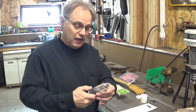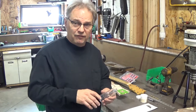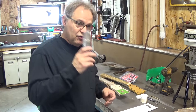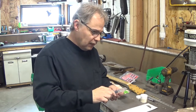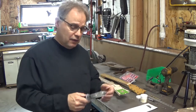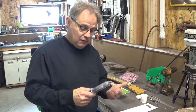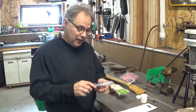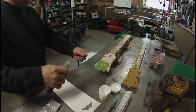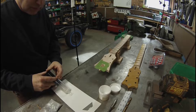I've tried several different kinds — you just want to test it before you use it for your inlay. Make sure it doesn't yellow. I've had some that supposedly are clear but they dry to a yellow. I've used this one several times now and it seems to stand the test of time — I've got it in some guitars that are 10 years old and they're still holding up, haven't changed color. Of course the manufacturer can always change specs, so you always want to test a little bit before you put it on your guitar.